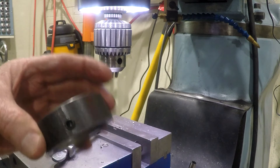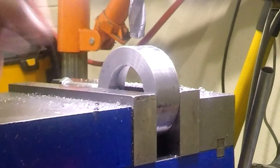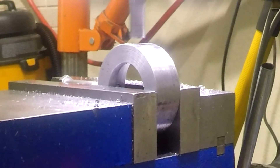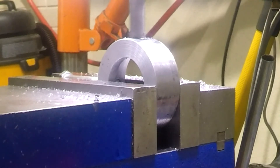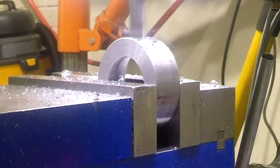That's the finished product as far as the die holder itself — now I've got to get the handles on it. The last step of the machining is to mill a couple of little shallow sockets to seat the end of the handle in, and that'll get me spotted. I just have to make sure it's perpendicular so that the handles line up with each other, then I'll braze them in place. Going an eighth of an inch deep after touch-off with a two-flute center cutting end mill.